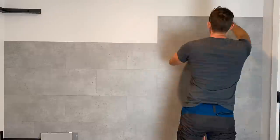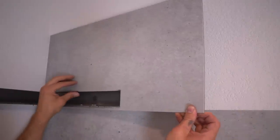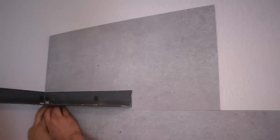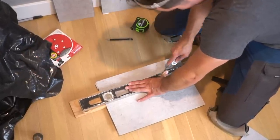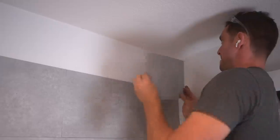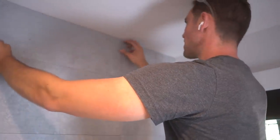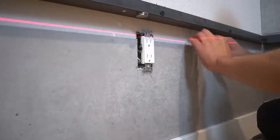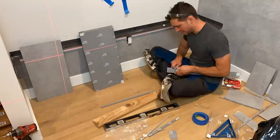As I worked my way up the wall, I did realize I didn't quite measure this bracket to the correct height because we had to cut the very bottom row — so think about that on your project if you don't want a small channel. We made it work, and if it does come loose, you can spray a little contact adhesive in there since it's such a small section. At the very top row, you do want a bit of space between the ceiling and the top of your tile — I combat this with a clean finish by coming back with some caulk to fill that small gap. On the second wall, this product easily maneuvers around outlets and light switches for a seamless look.